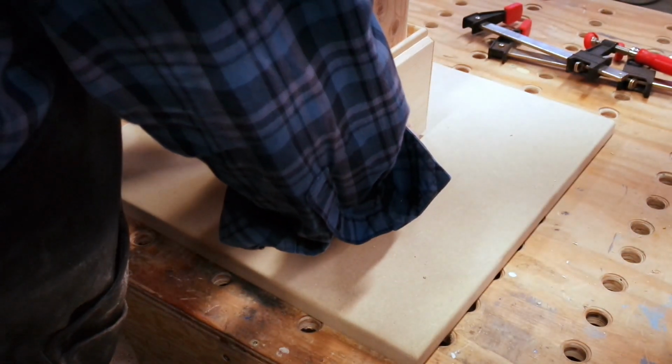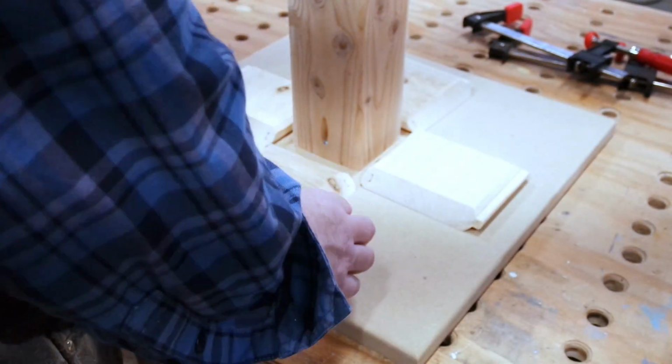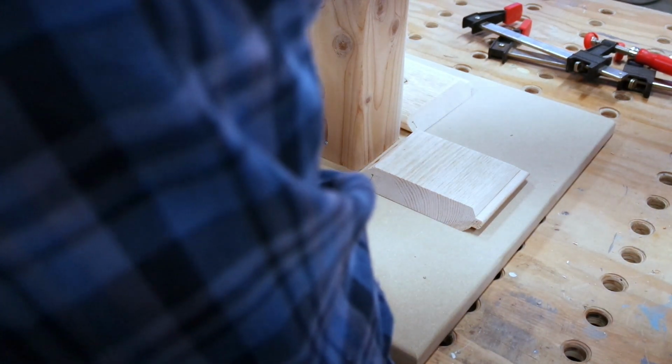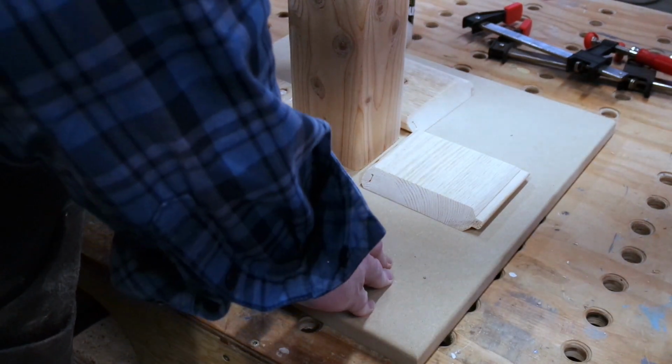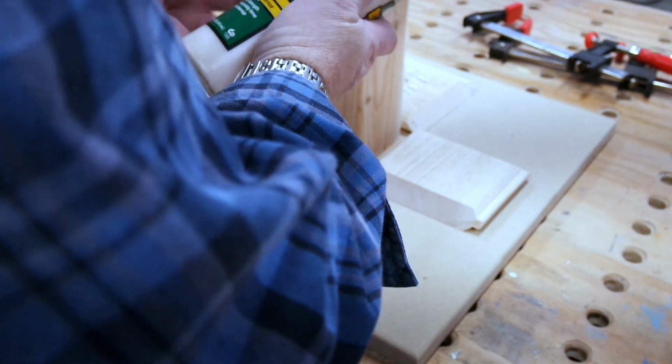All right, so I like it. So keep those all right there. Love me some wood glue. Makes it as strong as possible. Put it on all 4 of them. I'm using Titebond 3 just because there is a possibility that these could get wet. It rains a lot here on Whidbey Island, so if we're going to use these as a coat hanger, somebody's going to come in with a wet coat. So let's see what happens.